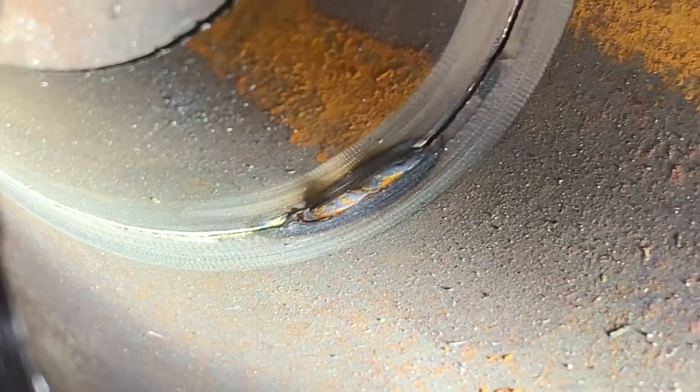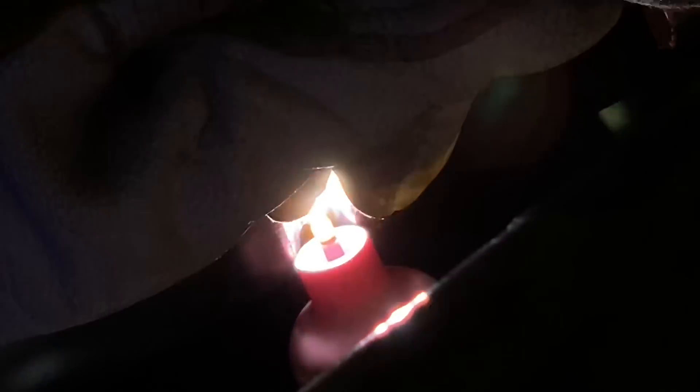You don't have any arc wander — you get the perfect angle that you want. And you can see there the penetration that we're getting from face feeding, and that's at the bottom. He's going to pan in and out to show you guys we're actually welding this on the bottom. Basically what we're doing is keeping a real tight arc, a real small weld puddle, and we'll go back and forth then add wire. Wiggle back and forth — here it is coming up the side from the bottom.